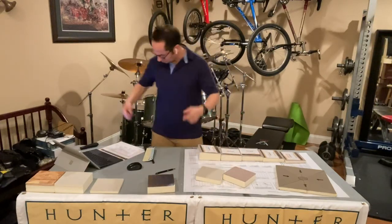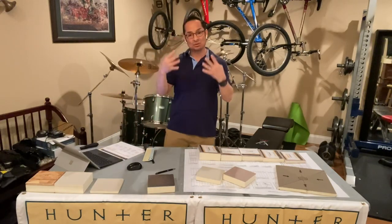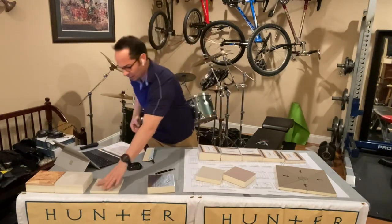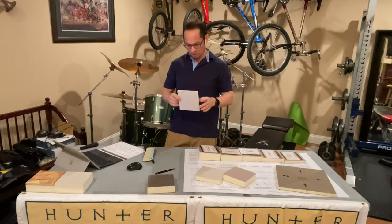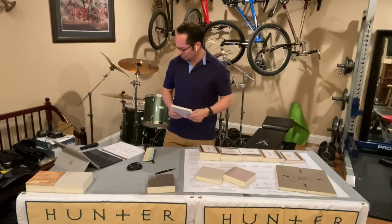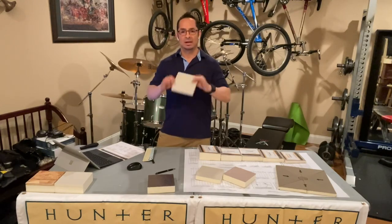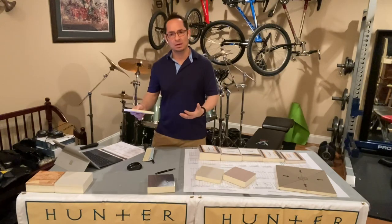All right. Now, let's go to type 2, class 4. Not 8, 4, class 4. Now you're getting into your half inch high density polyiso. This is also going to have your coated glass facer on top. Type 2, class 4, half inch thick, 80 psi up to 109 psi.